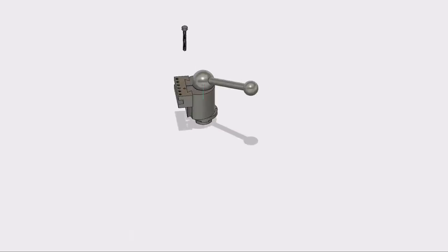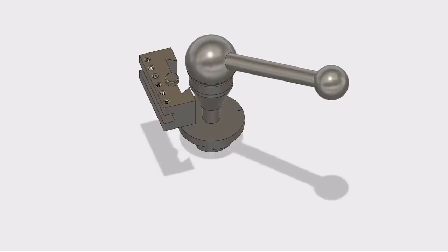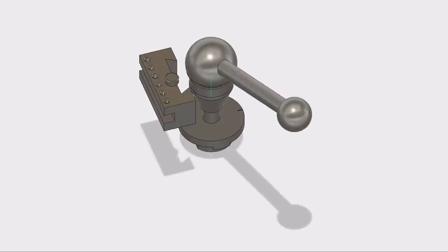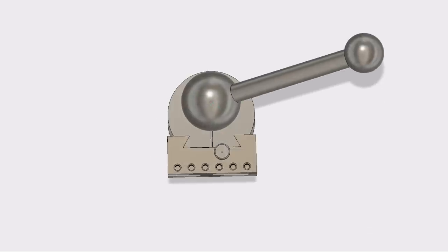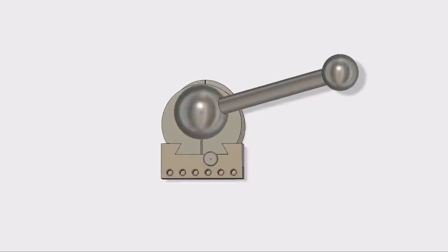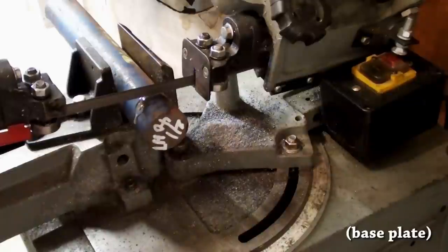and design. As I said, the design is very simple, and it's also very rigid. The locking nut pushes the cone into a matching taper on the body. This spreads out the split dovetail, locking the tool holder to the body and the entire tool post to the cross slide. This tool post has the rigidity of the common Aloris style quick change tool posts, with the flexibility of the old school lantern style. Great for the home shop. On with the build.